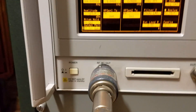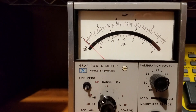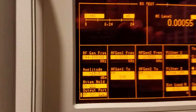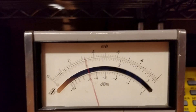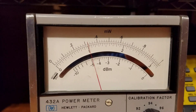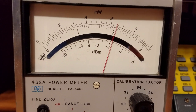Now I have the power meter connected to the RF out on the signal generator. I've had to change the scale a little bit — RF out can't produce as much RF as duplex out, so I've changed this to the minus 10 dBm scale, where zero dB at the right-hand side is minus 10 dBm. I have the signal generator set for minus 15 dBm. Enabling the output — we're expecting minus 5 on the power meter, and it's pretty close. Stepping through: minus 14, minus 13, minus 12 — it's tracking pretty well here too.